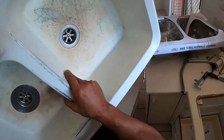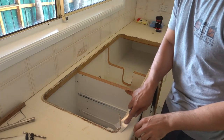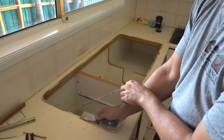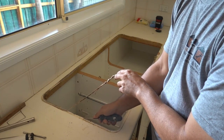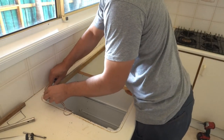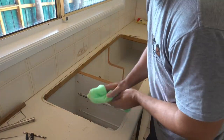Remove the kitchen sink and get this one out of the way. So now the whole sink has been removed. What we're going to do now is clean off all this adhesive — you can use a scraper, which should hopefully remove everything as long as it's not too strong an adhesive. Make sure you keep the scraper on the inner edge, you don't want to damage anything outside. We do have a little lip that overhangs so if we damage that little edge that's not a problem, but we don't want to damage any further out. So clean off all this adhesive and gunk that's been built up over time. We've got all the adhesive off now, just need to quickly clean this all off so that when we put our new adhesive on it has a nice clean surface to stick to.